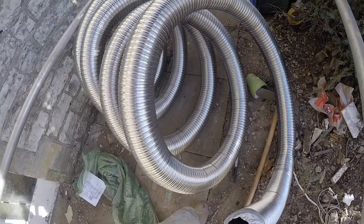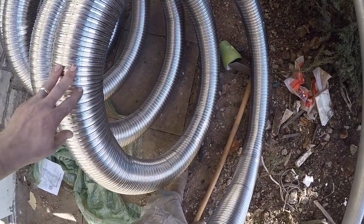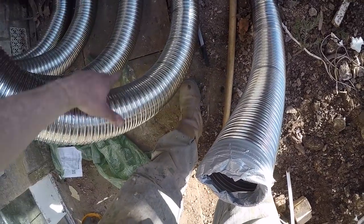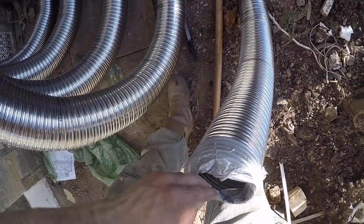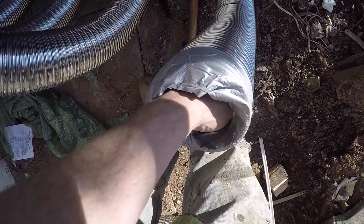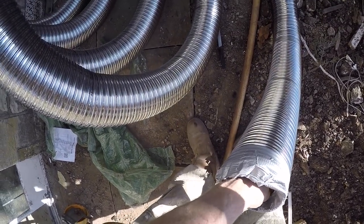We've got our five-inch liner now, just unwrapped. You want to make sure you know which direction the flue is meant to go — there should be arrows on it to tell you. Another way to check is to feel the grooves; you'll feel them one way where they overlap. You want to make sure any condensation that forms flows down those grooves rather than into them. So double check: look for the arrows, then check with your finger.